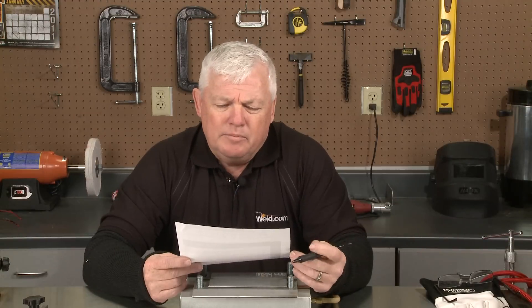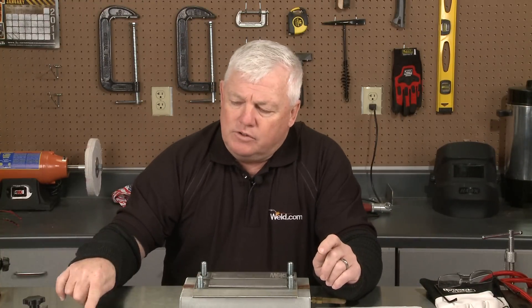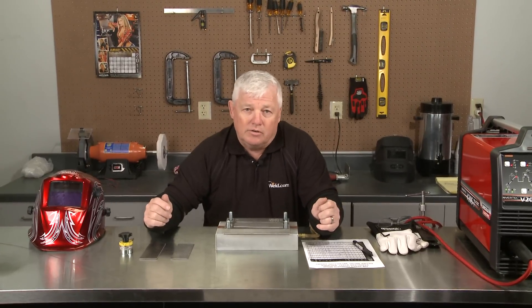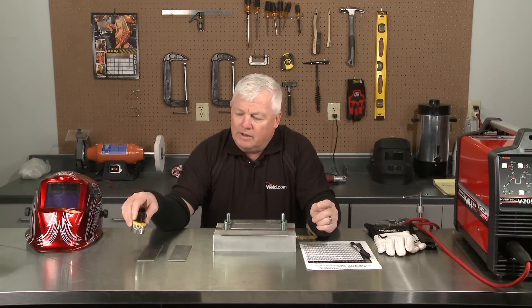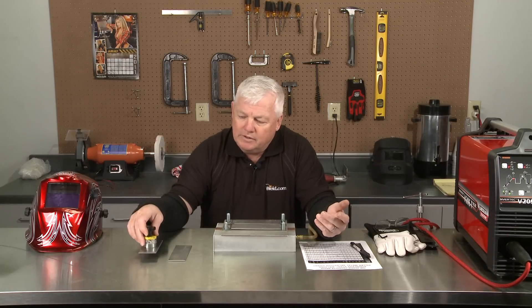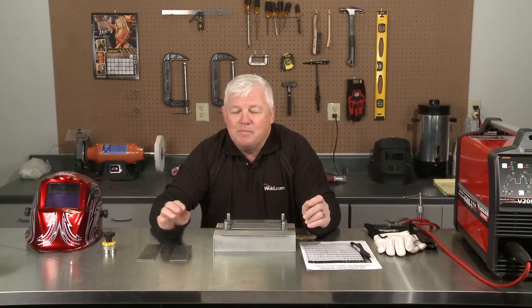We're going to weld 304, but we also want to do a little identification — how do I know I've got stainless steel? Sometimes out of the shop you have stainless and it may be 304 stainless steel but you're not 100% sure. A good way of finding out: I've got two samples of material here. One looks like stainless steel because it's a little shinier. One way to check is to take a magnet and see if it picks it up. In this case the magnet doesn't pick it up, so there's a good chance this is stainless steel — there's a lot of chromium in it. The other piece — let's check — it's mild steel. You can also grind the two and sometimes you can see the different sparklers that come off, but the magnet is usually the best one to use.